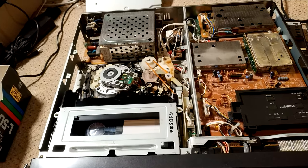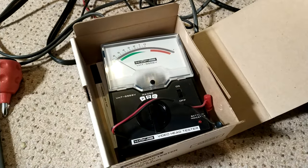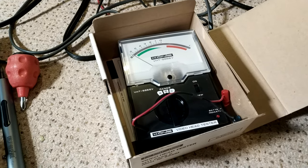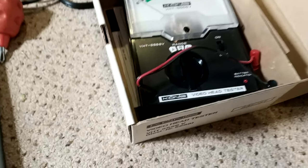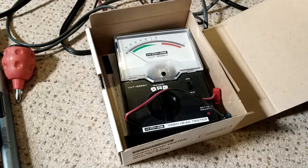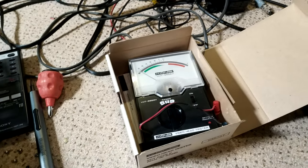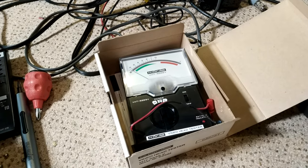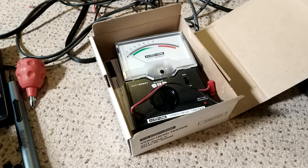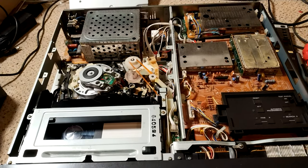Now, what I will do to confirm this is use a head testing meter. I know these things aren't 100% accurate, but they do give a good indication. Although this is a VHS type meter, I do know that if I put it onto B range, which you can see is already on, and test the heads, if they are good, they will show good. If they're bad, they will show bad. I've done it with another HF100 in this mode with bad heads and almost brand new good low hour heads and compared them, so I know what to expect. At the end of the day, it is what it is. It will do whatever, regardless of the format. You just need to know how to set it and how to read it, which I've sort of learned.